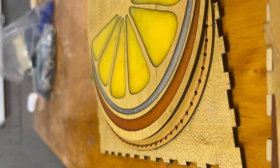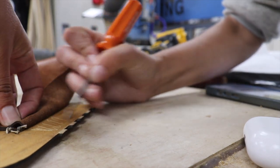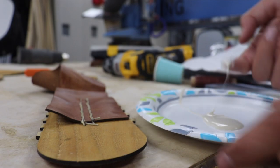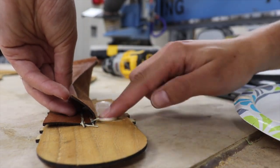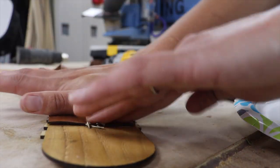Back over to the lining — I'm going to add some glue to this just so it will lay a bit flatter. To get it to adhere, I'm scuffing up the surface of that finish and then applying a liberal coat of Type 3 wood glue, and some pressure. Just like that.